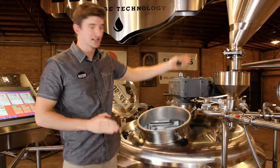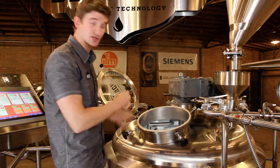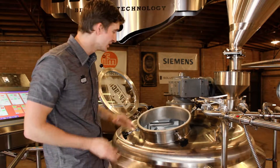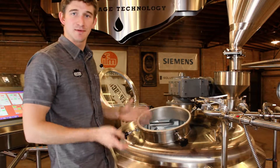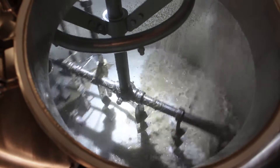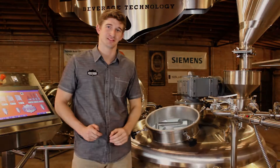The most important thing about introducing that grist is that you have a consistent feed into the hydrator. The more consistent you have it, the more consistent and uniform your actual mash consistency is going to be. This is going to decrease the potential for dough balls, hot spots, or cold spots — you're going to eliminate those and have a more uniform, higher conversion. Everything is going to be better in your actual mash. Once your grist hopper is empty, all your grist is in your mash and all your water is there, then you're ready to begin your mash. Thanks for watching.